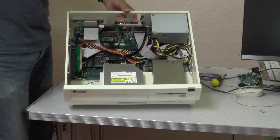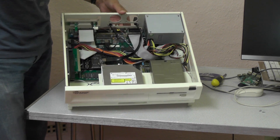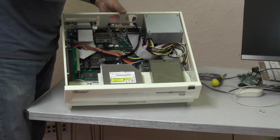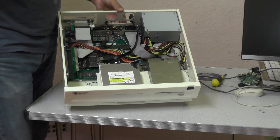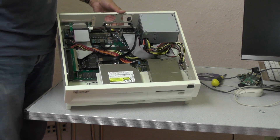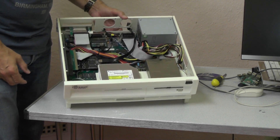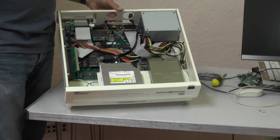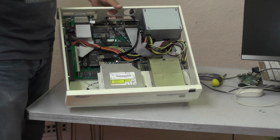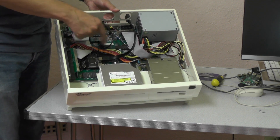You can still use all the chips — nothing is affected. When I've got two monitors, the demo on one screen comes out the Amiga chips and anything on the other screen comes out the Vampire. But if you put the 3.0 core on it's all HDMI through the Vampire. If you've got a 600, stick a Vampire in it and use it as a single monitor system with AGA — fantastic. I like to use my chips because I'm attached to the chipset, and they're continuing to develop the 2-series — not dropping it — just no AGA. I'm happy with that because I've got RTG which is amazingly fast.